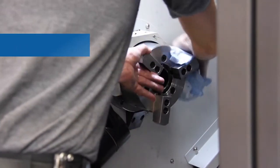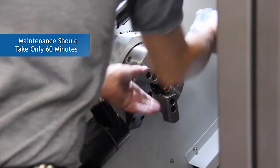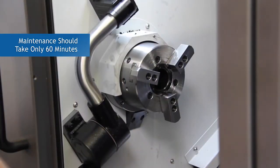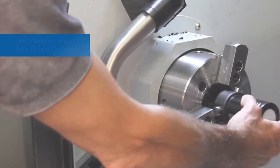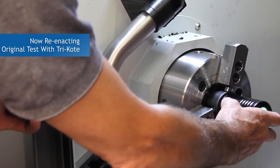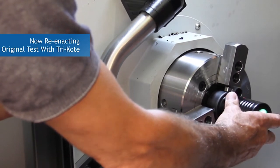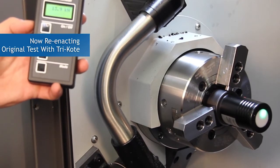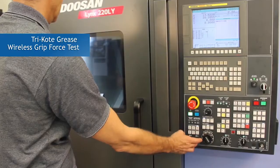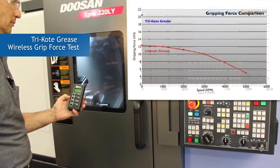As long as the chuck comes off freely, maintenance procedures including removal of the chuck, disassembly, cleaning, proper greasing, reassembly, and installation should take about 60 minutes. Re-enacting the same exact original test that we used on the standard grease, we will now see how Kitagawa's tricoat grease and lubricant will perform. The only variable changed was the application of tricoat lubricant to the chuck. As we did with the standard grease testing, we will take a measurement of the chuck in an idle position — the chuck is not rotating in the machine.